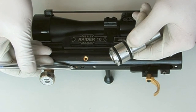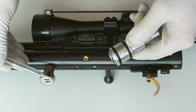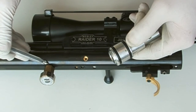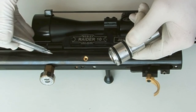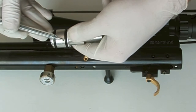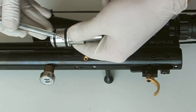There's another hole here for the stock's fastening screw, and then just here we have a pressure gauge on a brass mounting. The mounting is about 10mm, so there's a 10mm hole here in the reservoir itself — far bigger than the 1-3mm hole we recommend for your air regulator fitting.